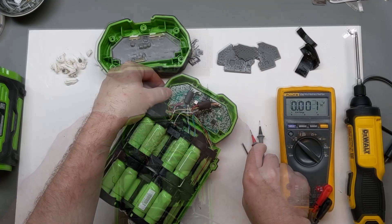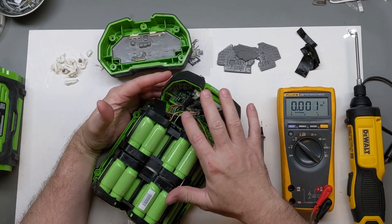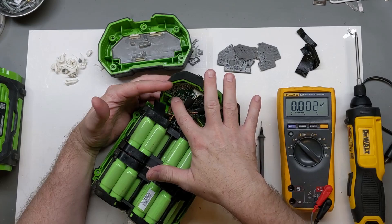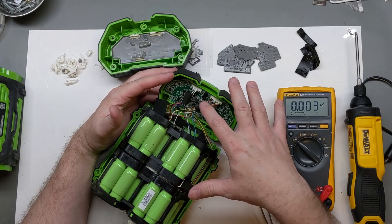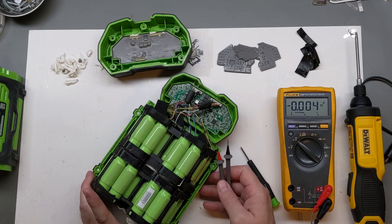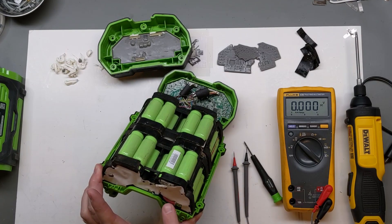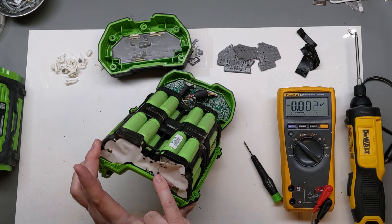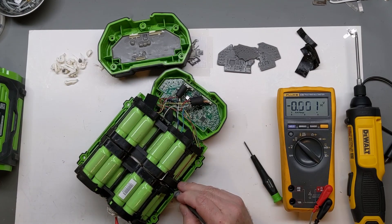In a previous video I discussed the wiring and even did a wiring video for the 2.5 amp hour for a viewer. I know that between B12 and B13 will be the yellow and the white wire. That's important because it helps me distinguish which one corresponds to B12 and B13. This red wire goes all the way to the connector — that's probably B14. Here's the white wire, and you can barely see the yellow wire coming up. Going from white to yellow, there is my 1.9 volts.